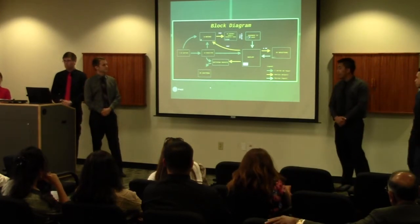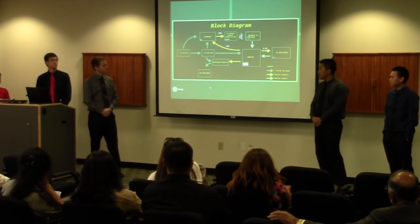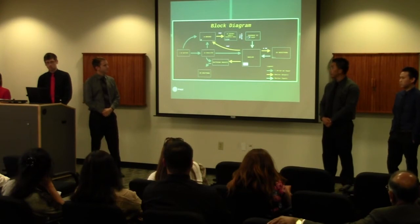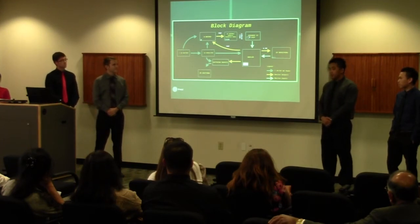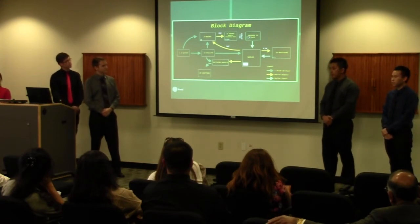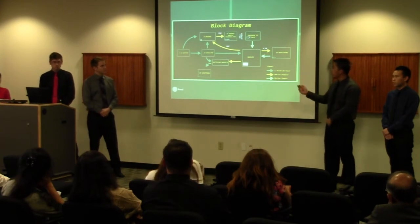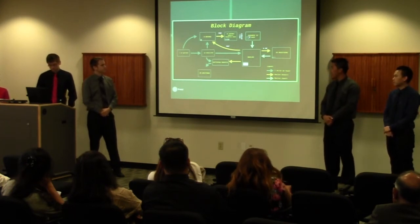I'm going to give you a brief description of the block diagram. We have a power supply of 7.4 volts, which feeds our H-bridge and a 5-volt regulator. We need the 5-volt regulator for components that only use 5 volts. From our Nucleo to our H-bridge, it sends a PWM signal, and the H-bridge controls the speed of our DC motors from that PWM signal. From the DC motors, the encoder uses a Hall effect sensor — when the DC motor shaft spins, it generates a magnetic field, and the sensor outputs a variable voltage. The encoder sends a signal back to the microcontroller. The receivers and emitters work in a pair: the emitter shoots out light and the receiver sends data back to the unit.